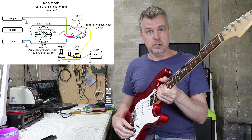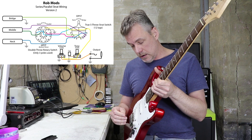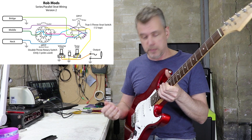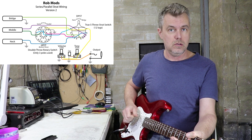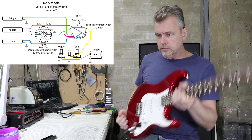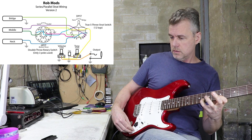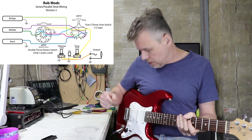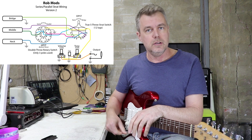In this version of the circuit, the mod switch is just a two-way switch, and I think it works a little more intuitively. It only operates when the Strat switch is in positions two or four — the combination pickup positions — and it is literally just a series/parallel switch. So here's the neck and the middle in parallel, and there it is in series. And for what it's worth, I'm really happy with the way my new tone pot works — it seems to roll off the treble quite gradually and evenly through the sweep of the pot. Let me know in the comments if you'd like to hear more about what I was doing with those wires and the processes I went through to choose those parts for my tone control.